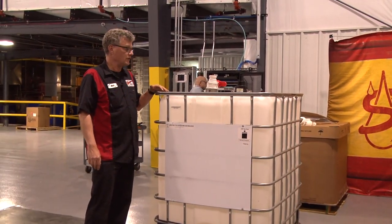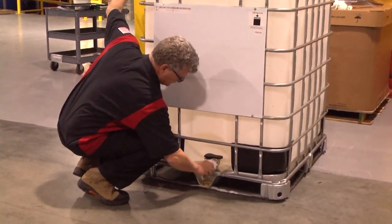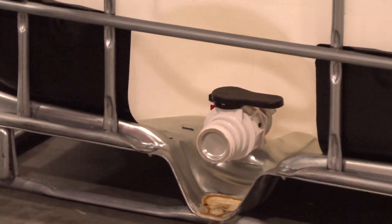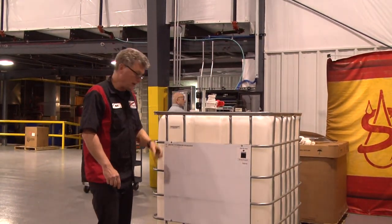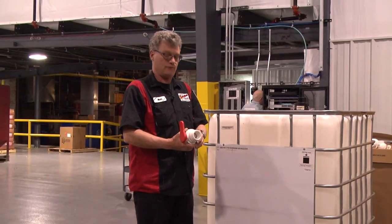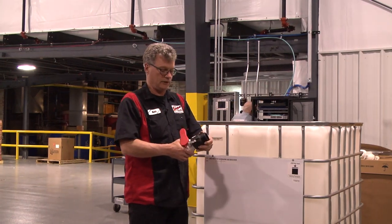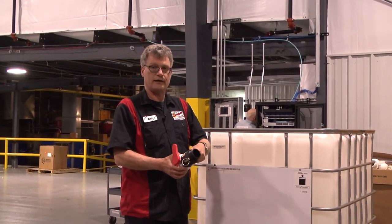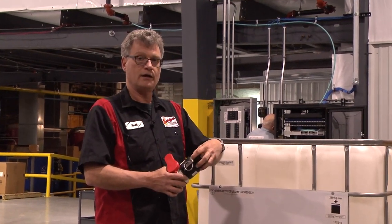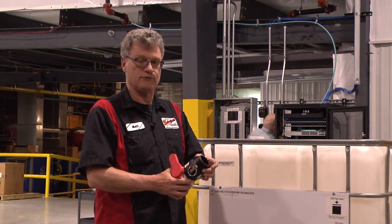Now all of our totes come with a quick disconnect valve. This is the dust cover. All of them have that foil seal on there indicating that the valve is new. A new valve is very, very important. All of the valve handles have a tie strap that needs to get broken to prevent accidental actuation of the valve itself. If your customer is still using the two-inch NPT, there are adapters readily available at all farm stores that will convert that quick disconnect to the two-inch NPT. At farm stores you can get all sorts of additional ends — some of them are crimped onto hose — but there are a lot of different varieties of adapters.